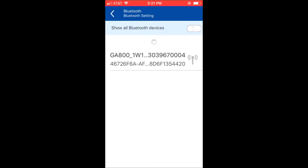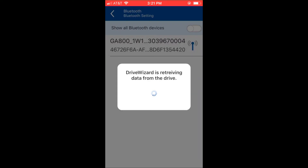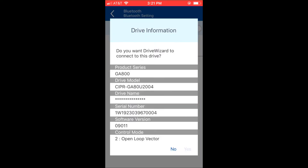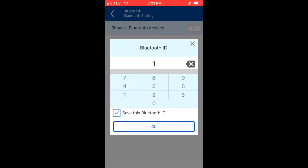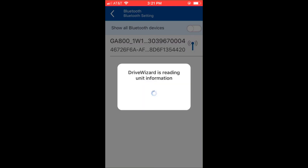Now I'm going to go into the smart operator and connect via Bluetooth to the drive. This is where I need to remember that ID code I set earlier in parameter A1-12. I set it as a random number, 1001. I'll go ahead and enter that here — it is important that you remember to set that parameter, because if you do not, you will not be able to connect to the drive and the application won't function.